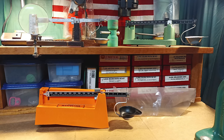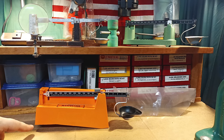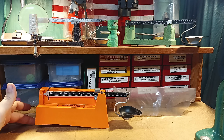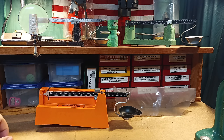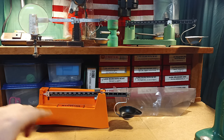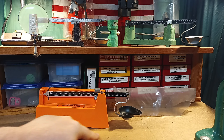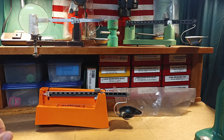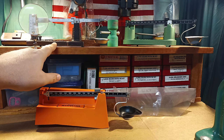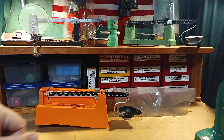Just a few more suggestions you can do to your scale. When leveling it, make sure the table is level, and level your scale to the table itself. This little adjustment foot that all these scales have — you want to find the neutral zone of where they sit. This scale is a poor example because everything's at different angles; the only angle that's kind of flat is right here, so you want that parallel with the table before zeroing your pan out. That way everything finds its little happy place. The base of the scale should be basically parallel to the table and everything else zeroed out.